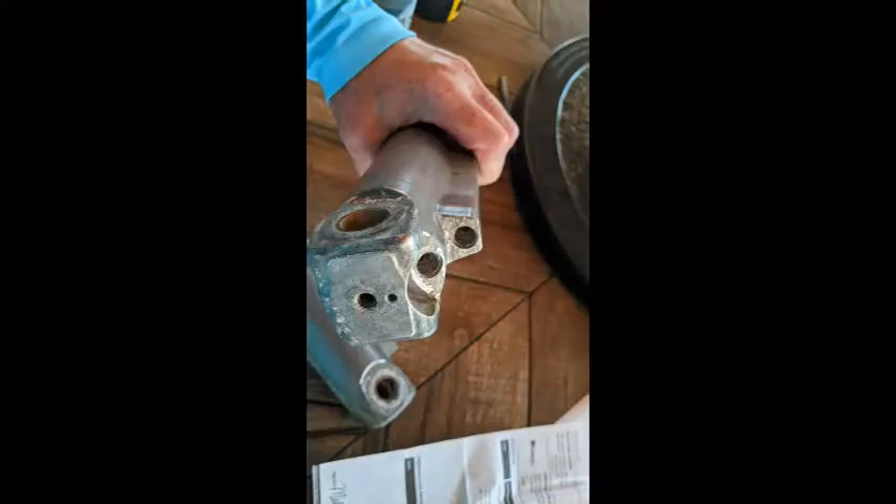This just shows you after I had them off. There's a ground that goes into that hole right there, and if you pull that ground out, it's actually hollow all the way into where the pin is. So you can try to spray some penetrant in there and try to chip out some stuff to help make it come apart easier. I didn't find that out until later. I did spray penetrant on this thing for weeks and it really didn't help — I had to get out the torches.